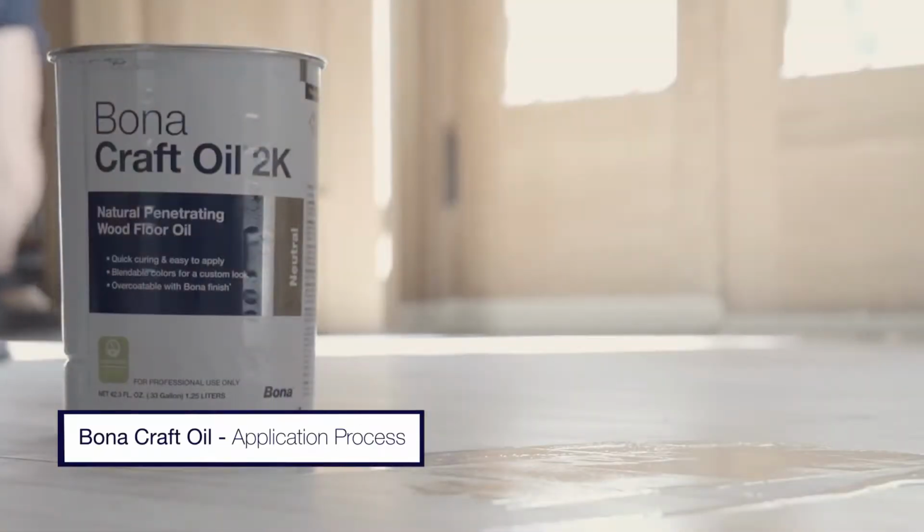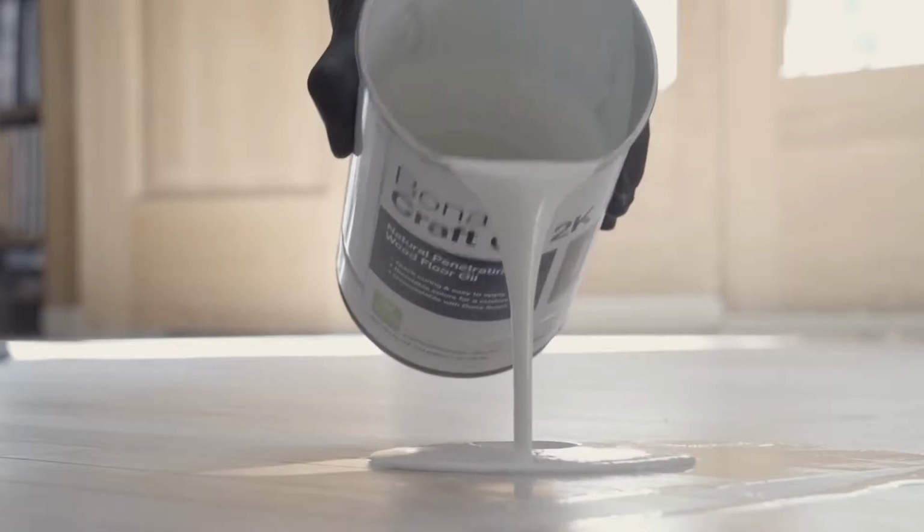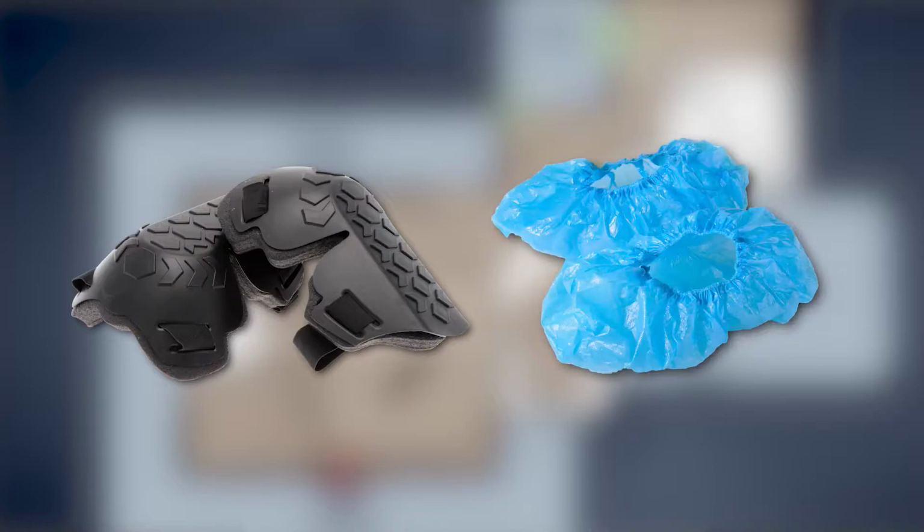In this video we'll be discussing the application process of Bona craft oil. The application process is simple and easy, but before you begin, have a game plan of where you want to start and find a convenient exit point. You will also want to wear knee pads and booties on your shoes to avoid getting any dirt on the floor. There are two recommended methods for the application process of Bona craft oil.